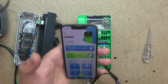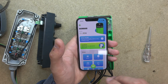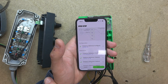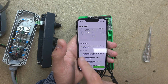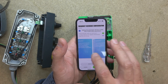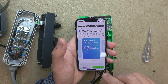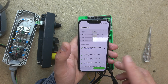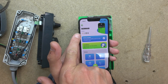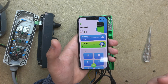The app looks like that. We're going to configure what we want those inputs to do. First thing: we're going to set up our speed. If you go into speed configuration, at the moment it's set to keypad — that's what we set up last time. Let's click on that and change it. We want to control by voltage. So, voltage — and we'll remove the preset because we don't want that. Let's apply that to the whole application. As you can see, it now shows yellow, indicating changes have been made that need to be sent to the drive.